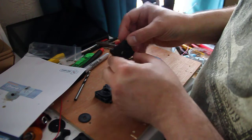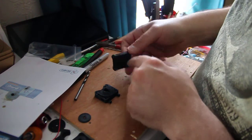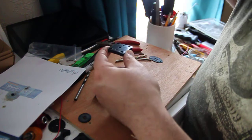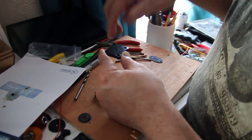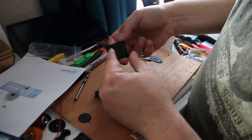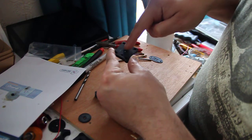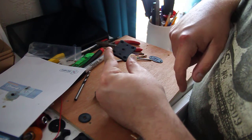The difference from the groove mount version is that this is the screw mount plate. On the underside — so this will be mounted this way up — there's a recess for the piezo, and on either side there are two holes. Those will have brass inserts inserted into them so that when you attach this to the underside of your carriage or effector, the two M3 screws will go down through the carriage or effector and engage with the brass inserts. The holes are 25mm centre-to-centre, equidistant around the hole in the middle for the filament.